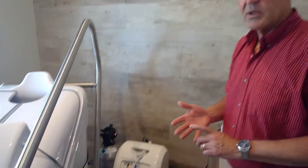At the end of the session, this vacuum tube is going to vacuum all the ozone out of the chamber and run it through our ozone destructor. The top hose comes here, the vacuum comes in here, goes through our filter system, and at the bottom it pushes fresh air back into the chamber through this opening. It's a closed system — we take ozone, convert it to fresh air, put it back in the chamber, so when we open the doors we have no residual ozone.